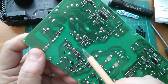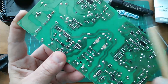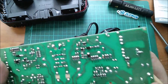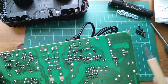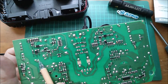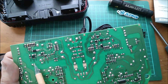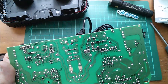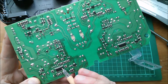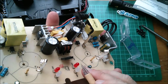There is a transformer for each channel. There are Class Y capacitors which are simply in series - the midpoint is not anchored to anything and they just link the low voltage DC side to the high voltage side. There's another pair with the midpoint just linking them together, presumably for voltage rating reasons in case the voltage exceeds the operating voltage of a single capacitor. On the low voltage DC side we have a large controller - perhaps 14 pins, possibly a microcontroller - controlling output to the batteries and also switching the red and green LEDs.